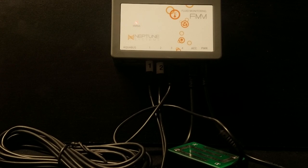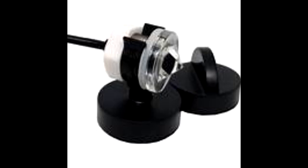In either case, the pump will be triggered to shut off. Port number four comes pre-configured to plug in an optical sensor where its normal operation is submerged underwater. This sensor is intended to be used in your Auto Top-Off reservoir, installed just above your pump. Should this sensor be exposed to air, it will prevent the pump from running dry for the maximum of five minutes discussed earlier. As you may have guessed, it would be a sequence of four beeps followed by a short pause.